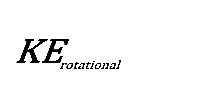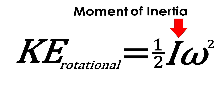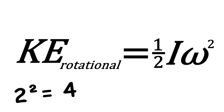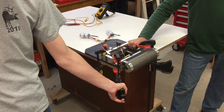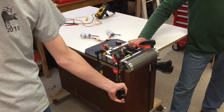The general equation for the energy stored by the spinning mass is KE equals one-half I times W squared, where I is the moment of inertia of the spinning weapon and W is the angular velocity. As can be seen in the equation, doubling the spinning speed of the weapon would quadruple the energy stored. Both Razor's Edge and this new robot we're building are designed to spin around 16,000 RPM, which is close to the maximum speed achievable due to air resistance, bearing speed limitations, and other factors.